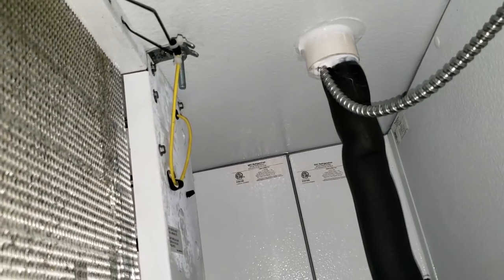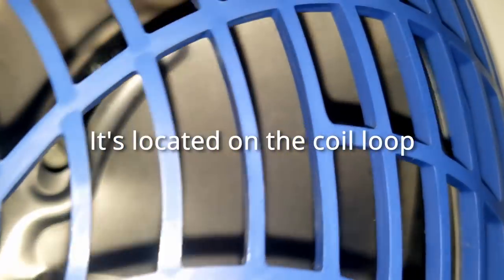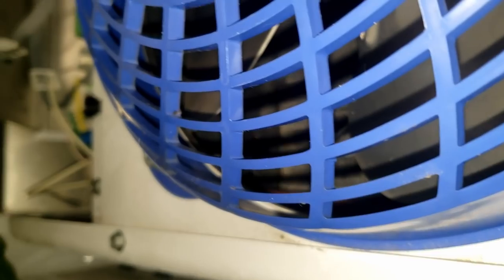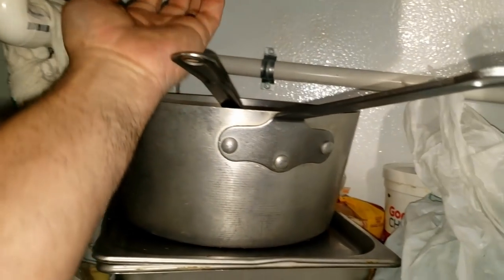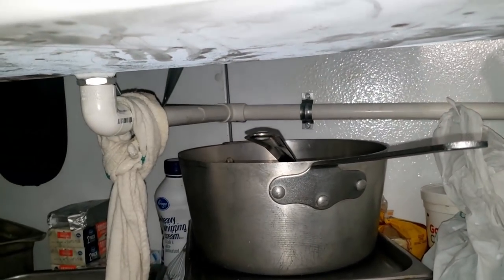So you've got your air sensor there, but the coil sensor must be... I wonder if they're doing it like some of their other stuff. I wonder if they're throwing it in there in the fans, in behind the fan somewhere, I bet you. Not seeing any wires. Yeah, the coil's cold. So that's what's happening.